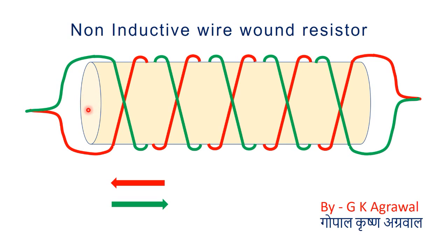If you see from this side, you will notice the direction of turns of the green color coil is in a clockwise direction, but the turns of the red color coil are in an anti-clockwise direction. So because of the clockwise and anti-clockwise directions, their flux gets cancelled. Suppose the green color wire has flux in one direction, and the red color wire flux is in the opposite direction — both are opposite in nature and will cancel each other, so the net flux inside this coil will become zero. So it becomes non-inductive.